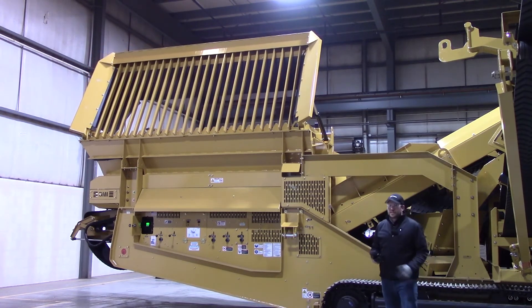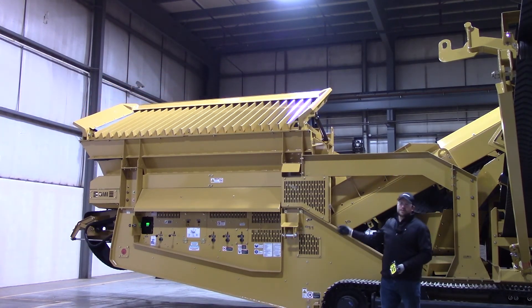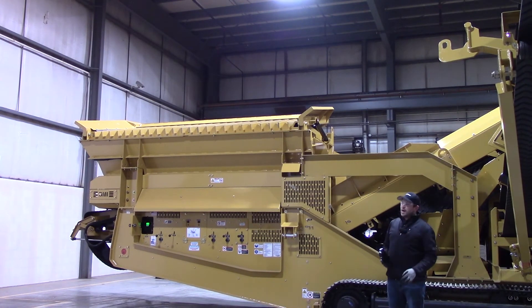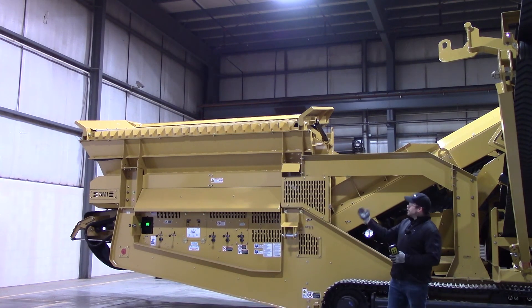Another good thing to notice: on the regular 514, if you need to adjust the angles of the tubes that this grizzly sits on on the backside, you can raise it all the way up and then hit the key switch or use emergency stop on the remote when it's in the up position. With this one, you really don't want to get underneath that grizzly and use the key switch while it's raising up. So if you need to do any adjustment on the backside, raise it up, utilize your wireless remote control, shut the machine off like that, and then your grizzly will stay up. You can adjust your angles and then just hit the button to get it back down.